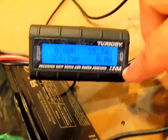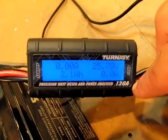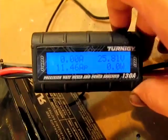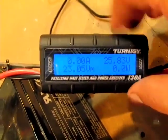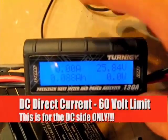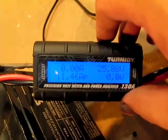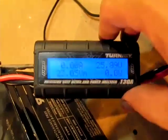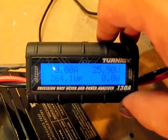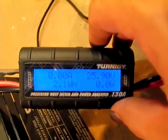Now with this device, it goes up to 130 amps, so the device can handle a really high amperage. What it can't handle is high voltage — this can go up to about 60 volts. If you go over 60 volts, you'll probably destroy this. So for any testing you do, 48 volts is fine, 52 volts — anything along those lines will work. You just don't want to go near 60 volts. Stay around the 50-volt area and you'll be fine.